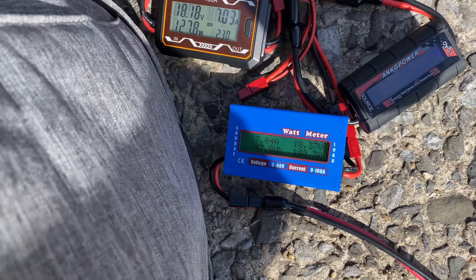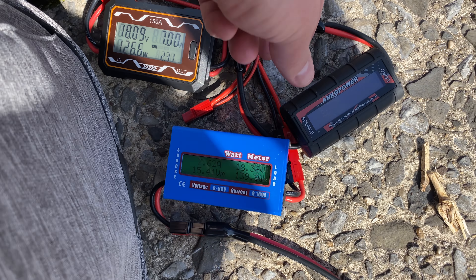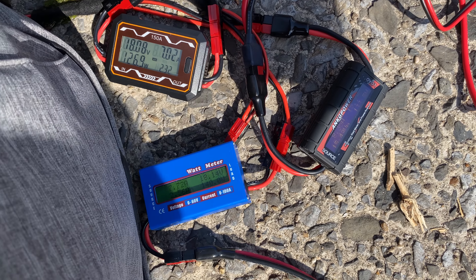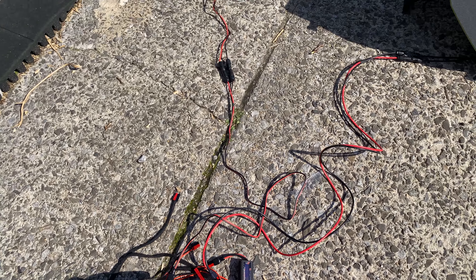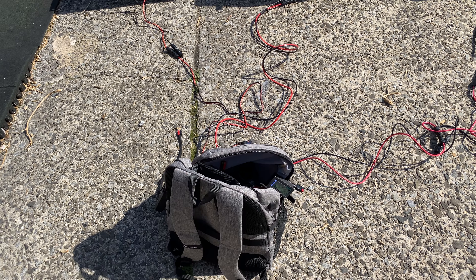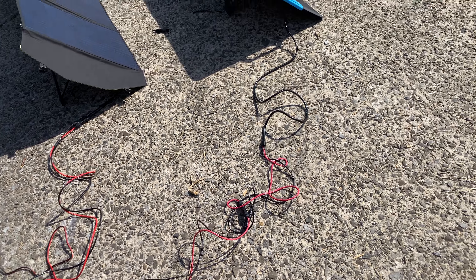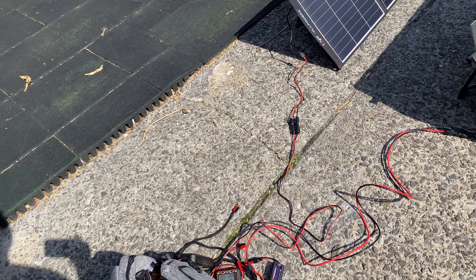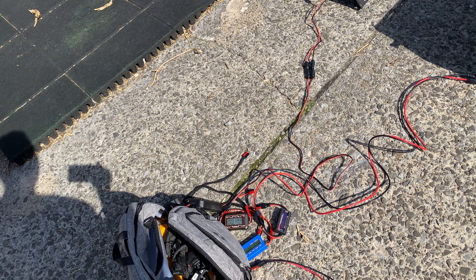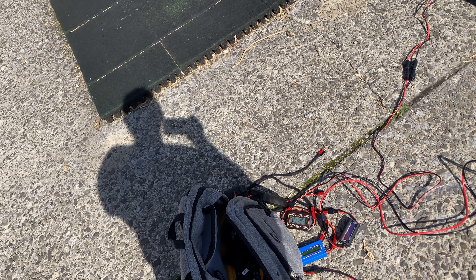Quick check on current wattages: SP035 is at 127W, SP033 is at 133W, and the Blue Eddy is at 140W. I'm not feeling any heat from these controllers — barely warm, probably more from the sun. Regarding solar generators: yes they have a fan that runs especially while charging. Battery packs don't activate cooling while charging, which I prefer.